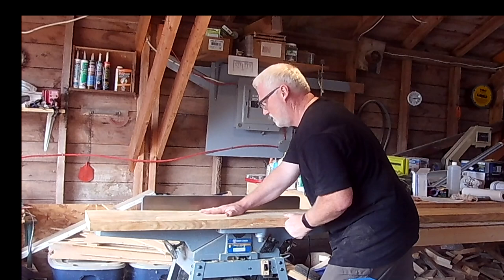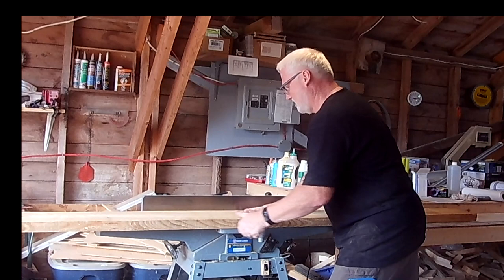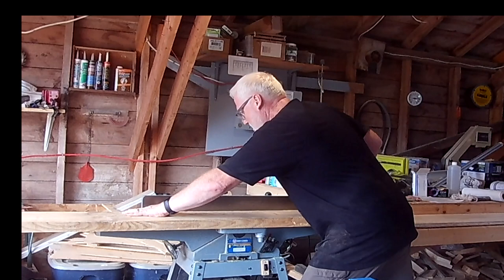The three sub-assemblies in this video are all rectangular in their final form, so a fairly easy process to mill and glue up the timbers. Each 2x10 rough cut timber had to be milled down to its final 1.5x9 inch size.